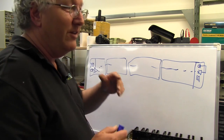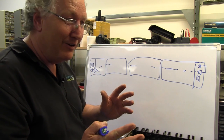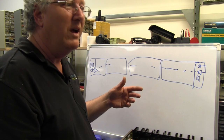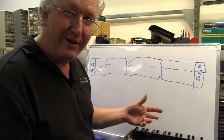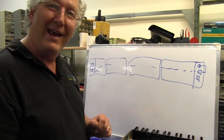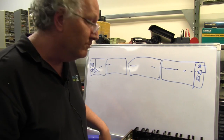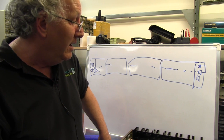There's dips, there's brownouts. They actually describe the spikes that they see on these lines, which extend from minor overvoltages of maybe 200 volts for hundreds of milliseconds down to 4 kilovolts for some microseconds. Ouch. And State Rail actually have a list of spikes that they have observed. So you have to design the amplifiers to accommodate. Do they have spike simulators to test that? So when you design gear like this, do you test it to their standard?